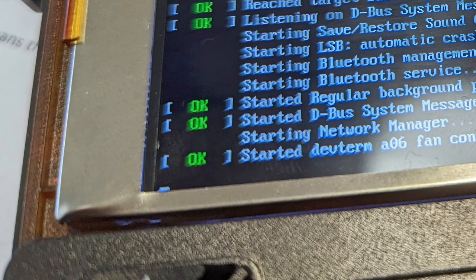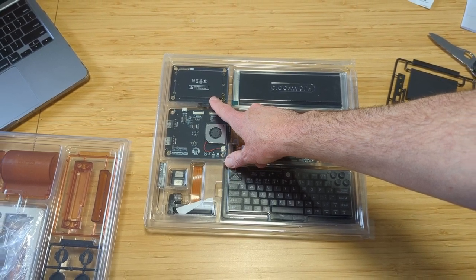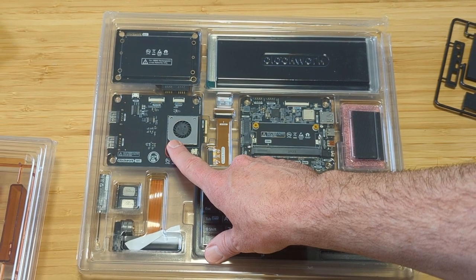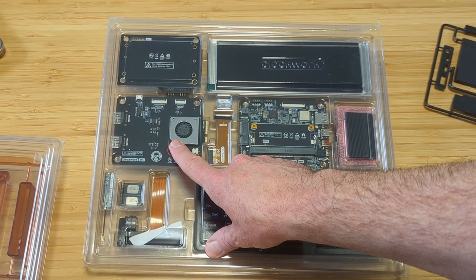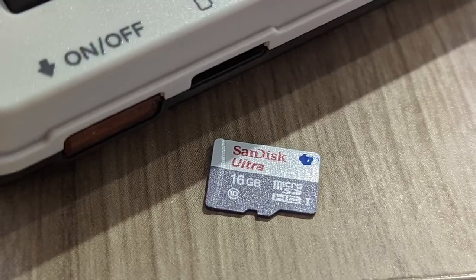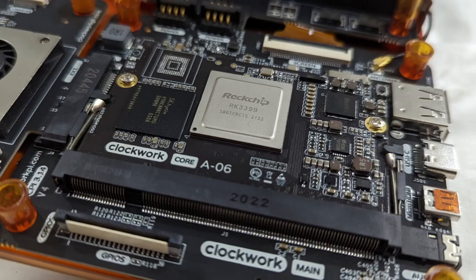Let's take a look at what's in the second tray. There's the IPS panel, and it has a dent — I hope that doesn't prove to be an issue during assembly. To the left of the display is the rechargeable battery module. The DevTerm doesn't use standard AA or AAA batteries; I'll discuss batteries a little bit later. Below the charger is an expansion port that includes a cooling fan, camera ribbon connector, printer ribbon connector, micro USB port, and two USB ports. On the reverse are two touch connectors for left and right speakers. Next is the display ribbon cable and a 16-gigabyte micro SD card. The operating system is installed on the micro SD card. In the middle of the tray is the main CPU module.